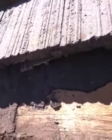What we do is we check the wood sheeting, see if it needs to be replaced, and we replace it. We're going to go ahead and change this little area — it looks fine, so there's no need to change it. Over here we got a little bit of corrosion, so we're going to go ahead and change that sheet.